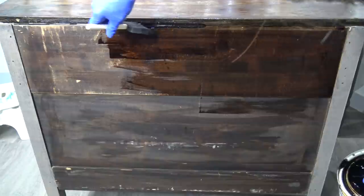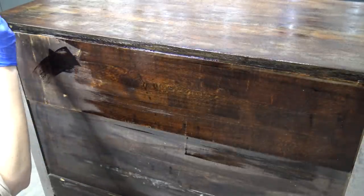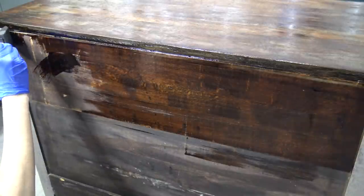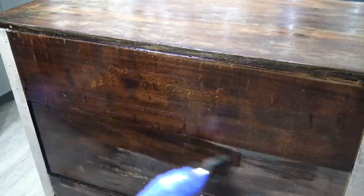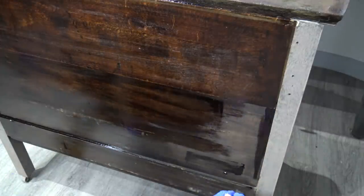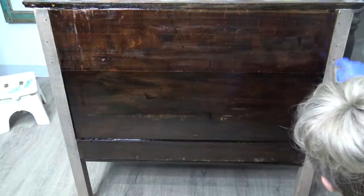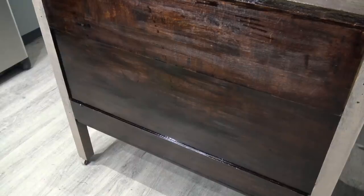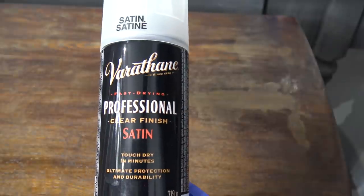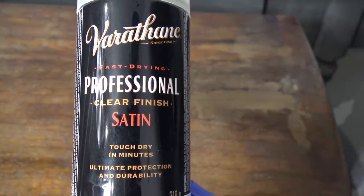The back of these old worn heirlooms can be pretty worn down, but professionally it looks so much nicer if you clean them — you can use a stain, an all-in-one paint — it just looks nicer for your clients. Everything inside and out being tip-top shows the level of quality and craftsmanship. I also like to wrap the original base paint color around the frame a little bit just to tidy it up, and once I've applied my second coat I'm going to put a spray Varathane on for added protection.